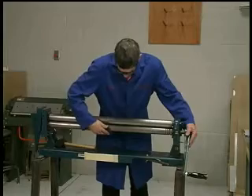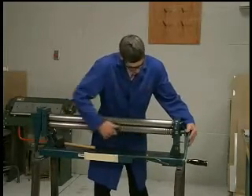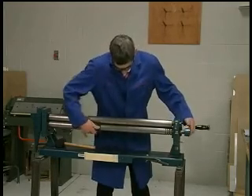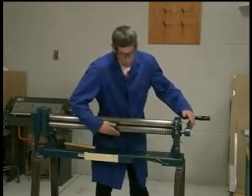For the bottom roller, you can rub it while you turn the handle slowly, making sure it's not going to pinch your fingers, applying pressure on the bottom of the roller rather than forcing the scotch-brite between the rollers.